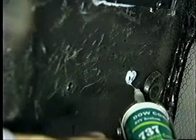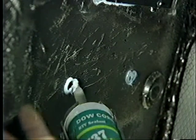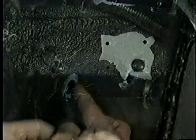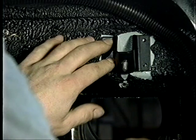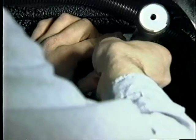Next, a neutral cure sealer is used when installing plastic plugs. These plugs fill the original HVAC mounting holes. The new HVAC upper mount bracket is then positioned above the square intake cutout, aligned with the four holes previously drilled, and riveted in place with the stud angled downward.